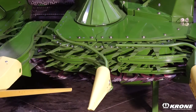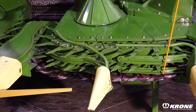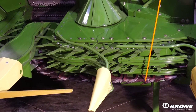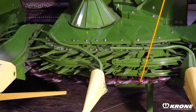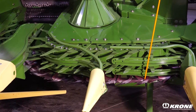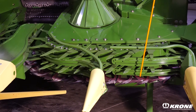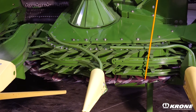Once it has that corn, it feeds straight across and into the feed rolls butt end first. This is a concept that hasn't changed from day one. What we have changed over the years is we've made them more reliable, allowing more acres on a rebuild. We've beefed up the bearings on the back side, beefed up the tracks that the bearings ride in, increased the durability of the knives and the drive sprockets, allowing more acres to be harvested before maintenance needs to be performed.